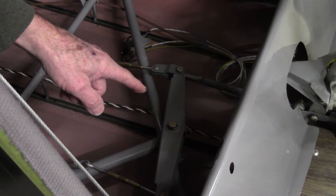The elevator bell crank Zerk fitting just needs a little bit of lubrication up on the top — it's a bronze bushing in there. Normal lubrication of those points is more than adequate. The Zerk fittings would typically be used a lot if you were in a flying school and the airplane was being used six or eight times a day. But in typical use nowadays, just lubed is good enough.